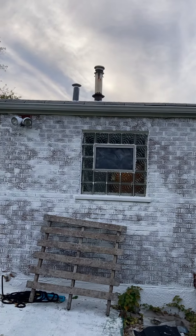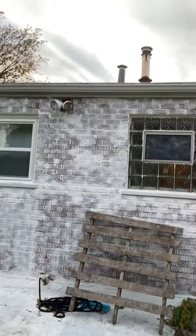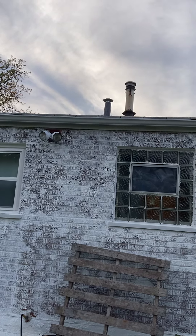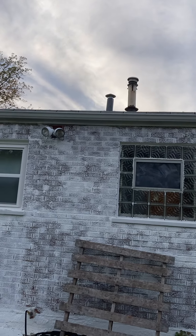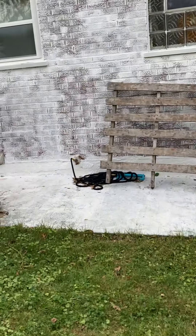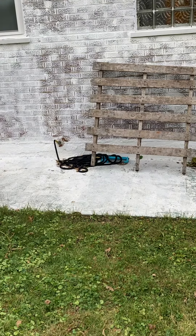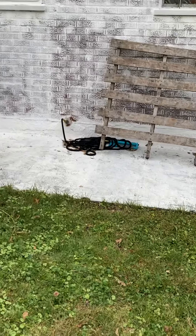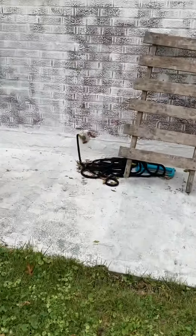We'll be coming back on the same spot for the furnace. You can see that flue pipe dropping down — it's a 6-inch flue. I'm going to give John the option to stay with the 80% efficient furnace, or we'll look at a high-efficiency furnace with a side vent to the outside. You can kind of see the transition between the foundation and where we're outside.